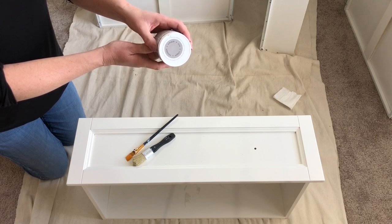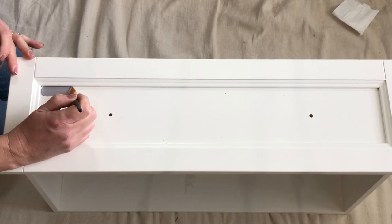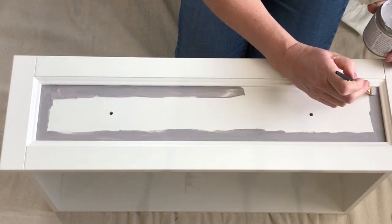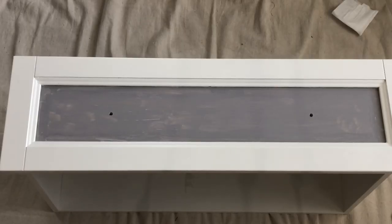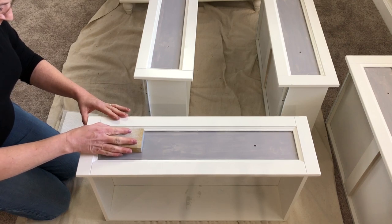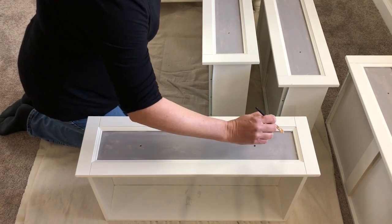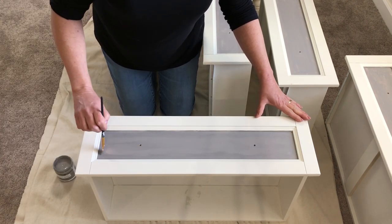Now that I have sanded those and wiped them down, I'm going to be painting the recessed parts with DecoArt gray chalk paint in the color Artifact. I also have this listed in my Amazon store if you are interested. I'm going to use a detailed angled brush to carefully go around this to make sure I don't get it on the outside of the drawer, but if you like you can always tape that up. After I get that first coat applied on all of the recessed parts, I'll allow it to dry, then take that 220 grit sanding block and go over it very lightly to make sure the brush strokes are nice and smooth. Then I'll remove that sanding dust and give all four drawers a second coat — it is just a gorgeous, beautiful gray color and I absolutely love this paint.